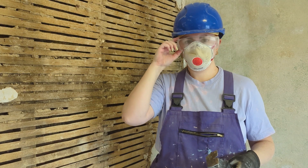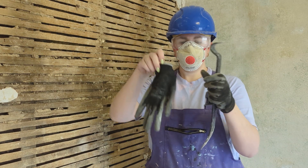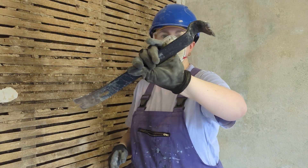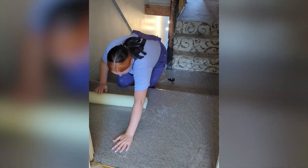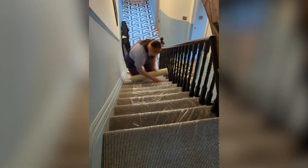Safety first: a hard hat is always good, goggles for any flying bits of plaster, a mask because it gets dusty, and gloves to protect your hands. The only tool you need is a crowbar with one flat and one curved end. You'll also want to protect any flooring such as nearby carpet, because the dust can be hard to get out of fabrics.